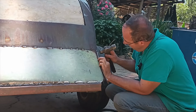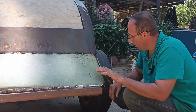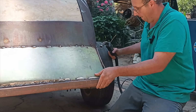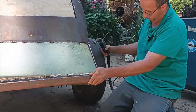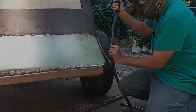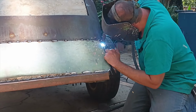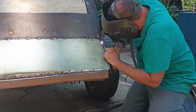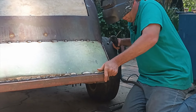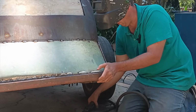The fun bit. Shape it to this. First I'm going to tack it and shape it to my edge so these two can meet up. And it will also make the car a bit stronger. Now it's going to come down small amounts like that, because the mudguard actually runs in there. Not so much of a curve. Then I'll cut it here and I'll bring my other piece around.